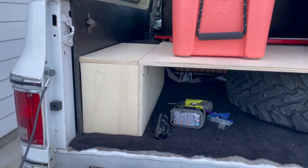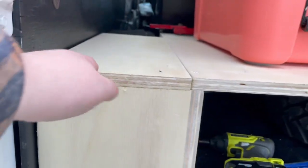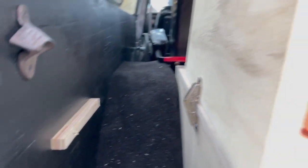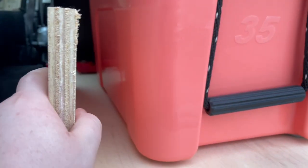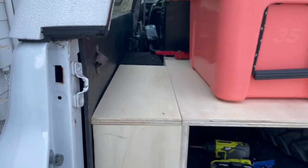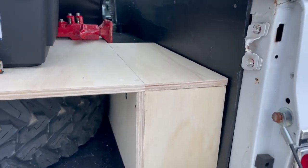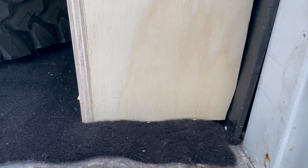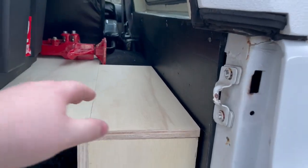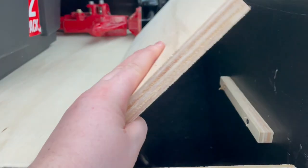I put these little covers on — it also helps to keep this flat and level. I also added these bumpers right here, so that when this goes down, I have to add an extra hinge anyway, but I also just didn't want it to go down too far. When it goes down, it's completely supported, and I can have a little weight on it, not too much. I did have to notch this just because of my side panels, but I might go back and fix it. This side's the same — I added a little stopper, a little bumper, and then I'm going to add a secondary hinge.